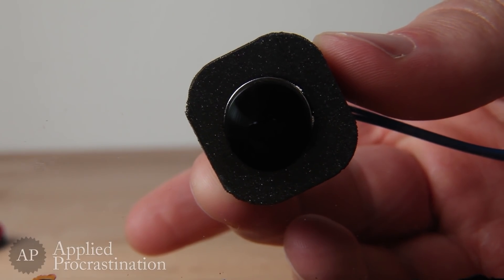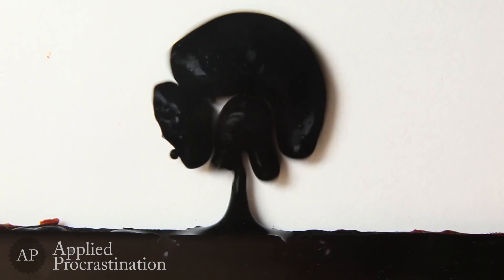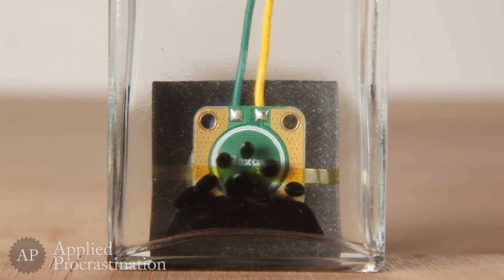In the end there's still a lot more oomph in the non-PCB electromagnets — and yes, these are definitely strong enough to be called electromagnets instead of just coils. But the non-PCB electromagnets come in a much larger variety of sizes and configurations, and you can just make one by coiling up some random wire you have at home. So the PCB magnets aren't going to replace those just yet. Additionally, you can't really use these in large vertical displays, but I do get some ideas for more compact systems where these could definitely shine. For us the best solution to reduce our wiring chaos would probably be to get some non-PCB electromagnets with stiff leads that can be soldered to a PCB like through-hole components — but we haven't found a source for that, so if you have any leads let us know in the comments.